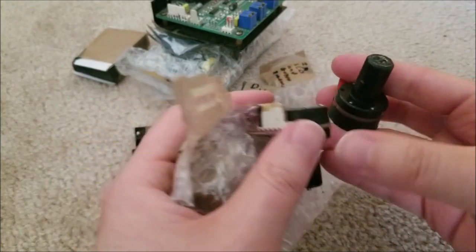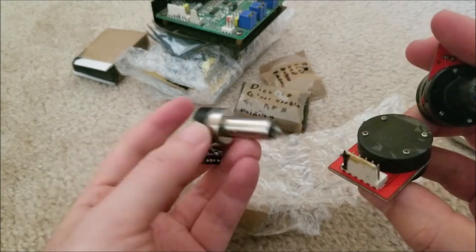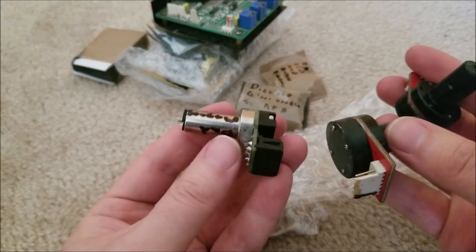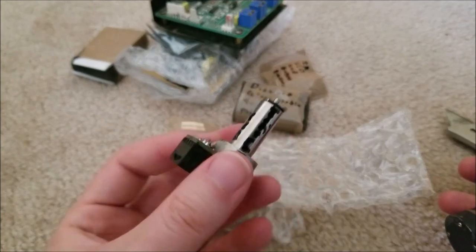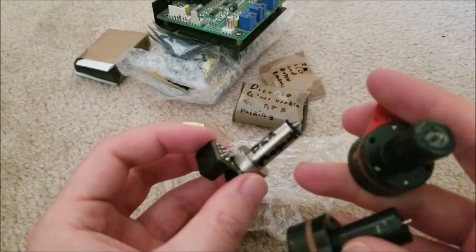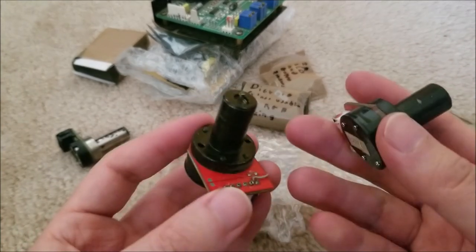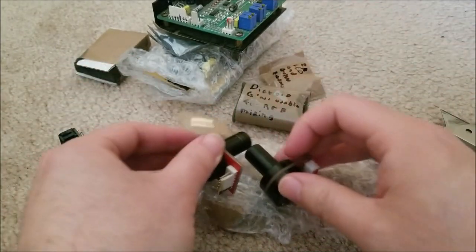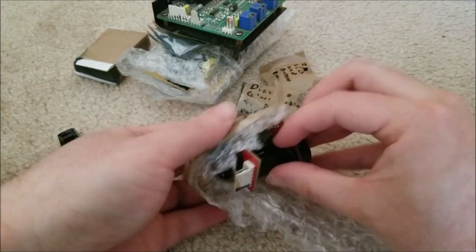These are a different style — that's interesting. They're completely different-looking Galvos. This one has a nice connector on them — I like that. These are definitely a bit smaller. This one has something bad with the magnets. He was telling me some of them got so hot that the magnetic rotor actually demagnetized, which is absolutely insane. This one we're actually going to be able to completely pull apart because you can't fix that, unfortunately. So this will be a complete teardown. The ones that just have sensor damage I'm not gonna destroy. I'll keep them safely in their little baggie with the information about what's wrong with them.